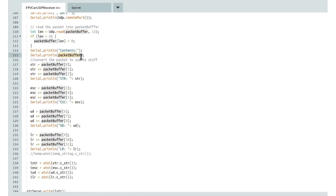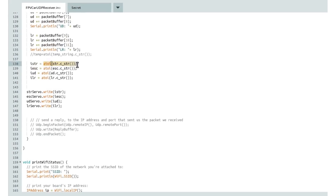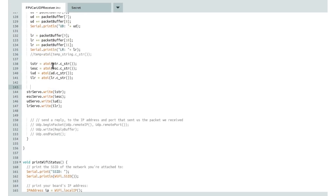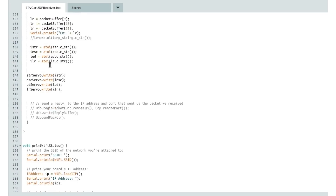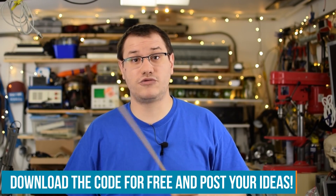We read the packet buffer and map these values to our respective ESC values. We read the first digit, put that into the steering value, then add the second and third digit — that makes up our first value to pass to the ESC, and the same for all the other values, each mapped to specific positions in the packet. Then we convert these values to integers so we can use them for math, and then set the servos to their respective values. You can tinker around with the commented-out code to add more functionality, and you can also make multipoint connections to different vehicles or more than one controller. You can download the code freely at element14.com/presents — link is in the description.